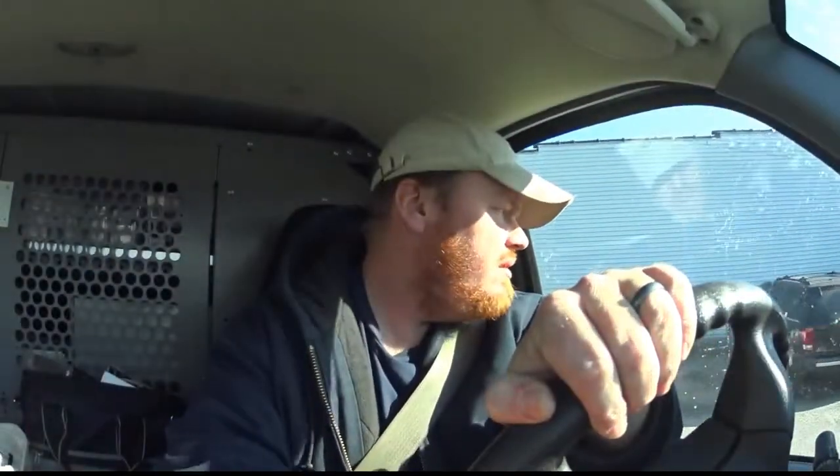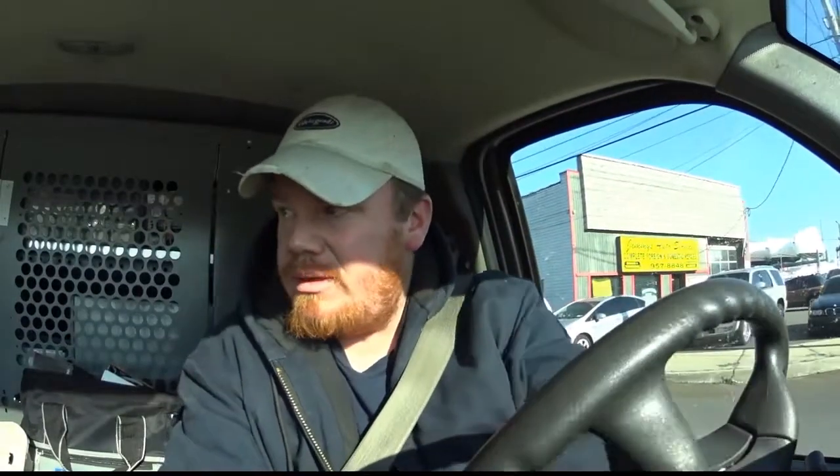Good morning YouTube, it's about 10:30 on a Friday, going into a pretty local call. I was out there last week and it was an issue with a blower motor — it's an older style blower, direct drive, needed to be oiled. It had, I'm assuming, never been oiled. It was making quite the racket, the bearings were making quite the racket. I used the zoom spout oiler and oiled it up, noise went away, everything seemed to be okay. Amperage draw on it was fine.